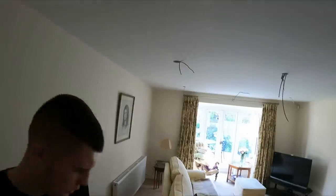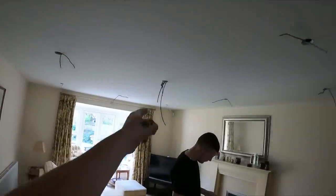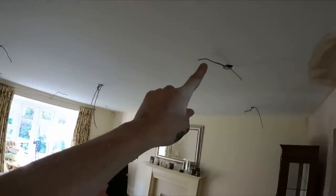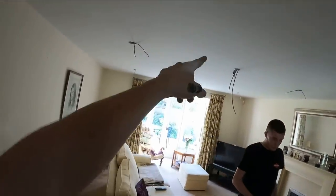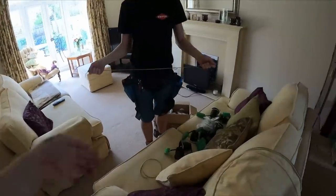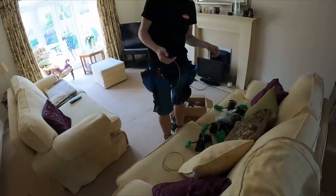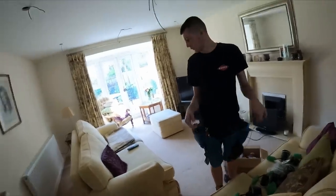We'll show you the runs. There we are. So we started far side, linked, linked, across, linked, linked, linked, across, linked, linked, linked. Sorry, that was the last one. So this long one here is the long one there, which will go into our JB, which Adam's going to do in a little bit. We're just going to put some JCC fire guards on, and some bulbs in, dimmable. We'll change the switch over. We're going to get these on, and then I'll run you back through what we're going to be doing with putting the floorboard down.